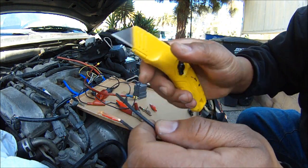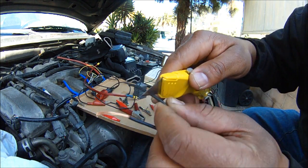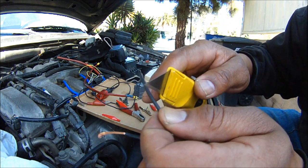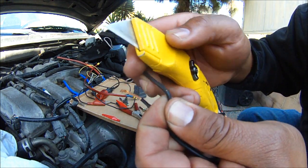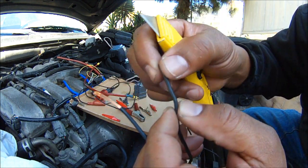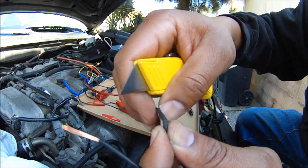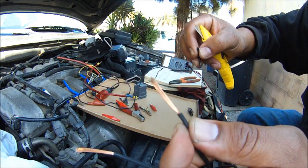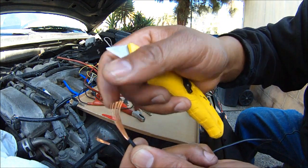Let me show you one more time. Just go around about an inch below the end of the wire, lightly pushing down, then bend it to open it up a little bit. It'll expose the wire on the inside. Make sure you don't cut through the wire or any of the strands in there. Sometimes you will, but just try not to. Break it loose, cut again, wiggle it around, expose it, grab your nail, slide it off. Make sure you don't cut each one of these strands — sometimes you'll clip one strand off, but try not to.